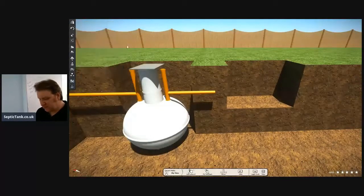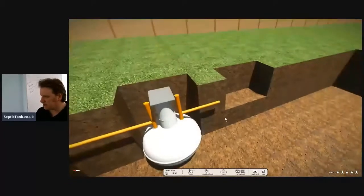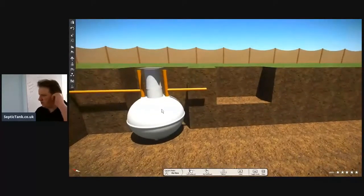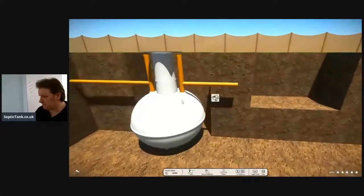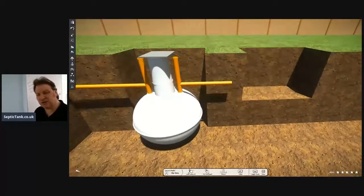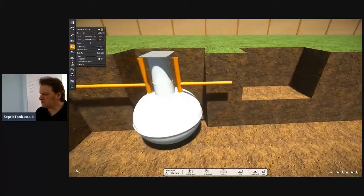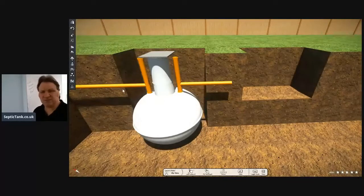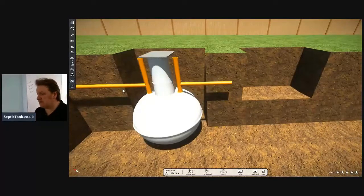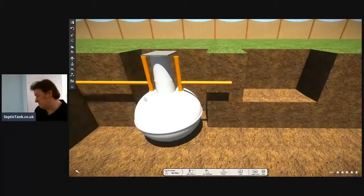There's the onion tank in the hole. This is a typical size onion septic tank — it's got a lid and they are quite big and bulbous. I'm not demonizing onion tanks — technology has just moved on. Onion septic tanks were great in their day, but technology has allowed the septic tank industry to get things done quicker, for less, and that last longer.